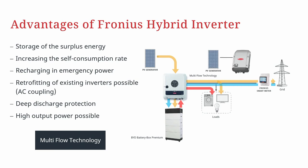Furthermore, there is so-called AC coupling, which allows you to always do an AC coupling with existing AC producers. No matter if it is a PV inverter, a small hydropower plant, or a small wind turbine, you can always use the AC power from such a source for your hybrid system. The Fronius Gen24 Plus will recognize the AC power coming from this external device over the Fronius smart meter and use it for charging the battery storage, energy management with the Fronius Ohm Pilot or Watt Pilot, and other energy management functionalities — without needing data communication between the third-party device and the Gen24 Plus.